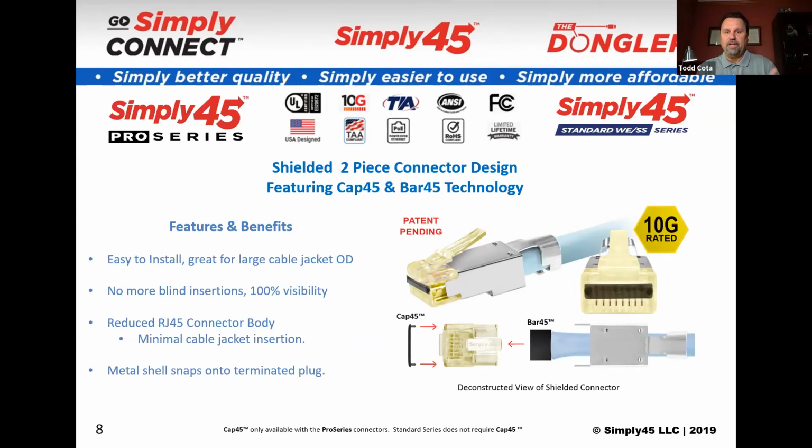And what that does, especially when you're dealing with large diameter cables, is that the connector is a solid metal body, right? It's a blind insertion. You're just hoping it all works, because when those 8 wires get untwisted, you're hoping they stay intact. And then when you crimp it, you close your eyes and cross your fingers, like, yes, I think I got it. Then you test it and you go, oh, that was a waste of 10 minutes.